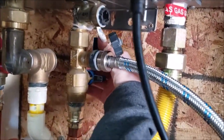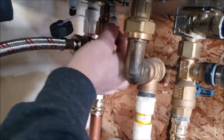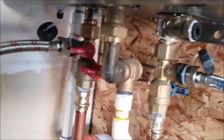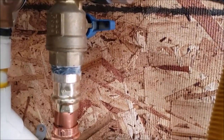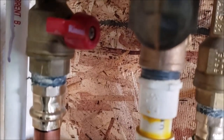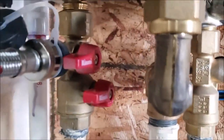So once those are off, then you can turn on the blue one on the top. That's going to open up where this hose is at. You're going to pull that straight down, and the hot one, you're going to pull that straight down. And so what you've done is these bottom valves, it shuts off the water going in and the water coming out of the water heater. These two top ones allows you to push vinegar into the unit and out of the unit.